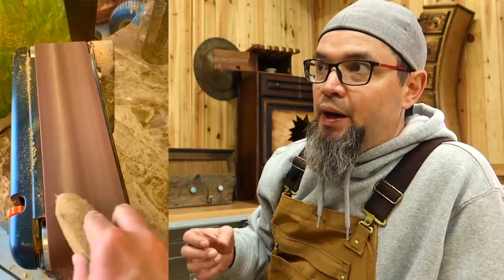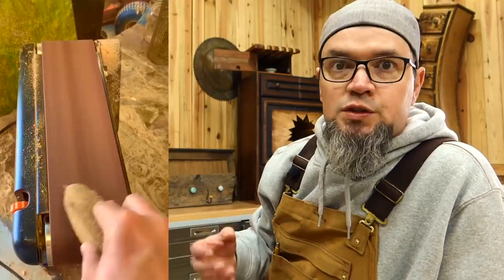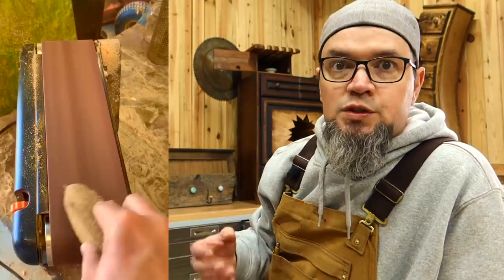This one went crazy — I'm not sure why — but this is just an abrasive cleaning stick. I use a lot of high-resin wood like pine, and it will clog up your sandpaper. This is a tip on how to remove that buildup instead of tossing sandpaper over and over — it's too expensive to do that. You can actually use an old shoe to do this, but they do sell abrasive sticks that are awesome and last forever.